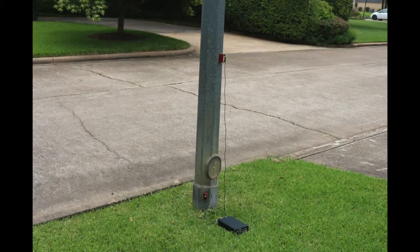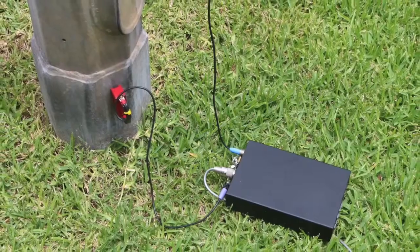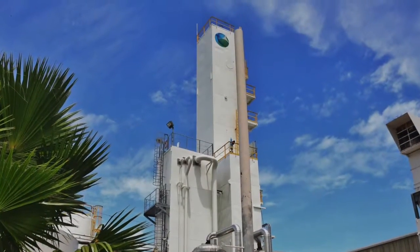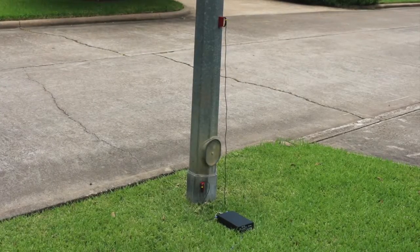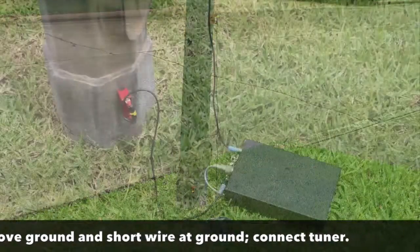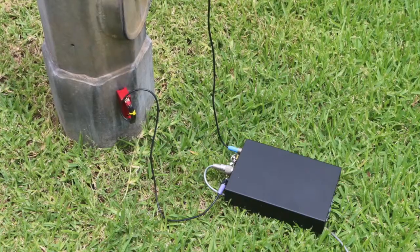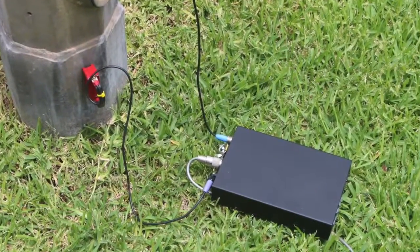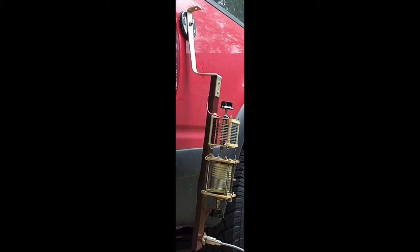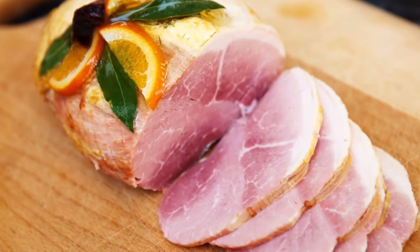This last antenna is a bit unusual and more for the experimenter — it is shunt feeding any large grounded structure. The idea is to get current to flow in the structure, making it a vertical antenna. It could be a fire tower, a lamp pole, or even a tall building or billboard. The shunt is made up of the loop created by the two connections and the included section of the structure. Here you can use the LDG or MFJ tuner, which will match the impedance, making current flow in the structure. The effectiveness depends on the structure and frequency, and could be anywhere from a great antenna to a very large dummy load. I have tried this using lamp poles and even a Ford Explorer with varying success. The best was a highway sign on 40 meters — it will get your creative ham juices flowing if nothing else.